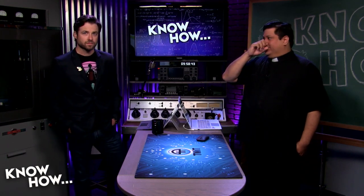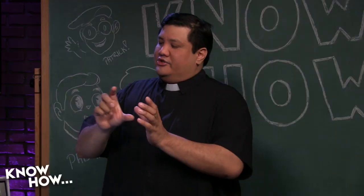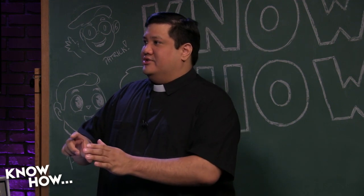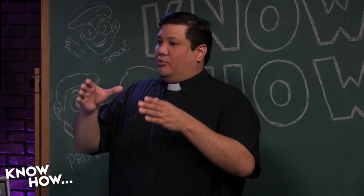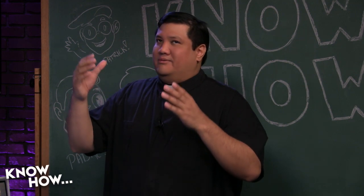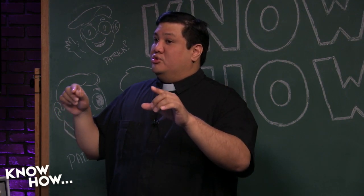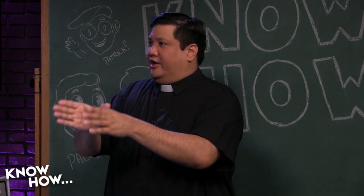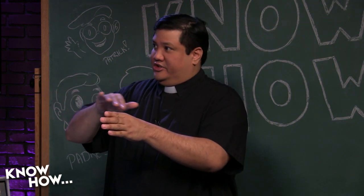One other thing I'd like to add to this project is, if he really likes the Raspberry Pi, there is a way to use the Arduino controllers as sort of the endpoints, and the Raspi is the brain. I see. So this is a project that I've been working on. Unfortunately, I kind of stalled because I got bored and moved on. That's what I do. But the Raspberry Pi is the web server, and then it connects to the individual Arduinos whose job it is to control their particular part of the automation. Okay. So all it does is essentially say, turn on one, turn off two, turn on three, turn off four, et cetera, and just goes down the line.